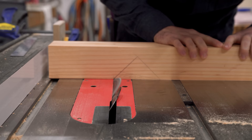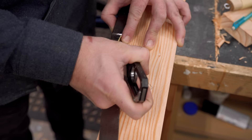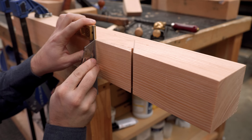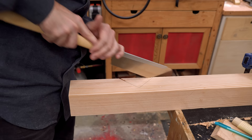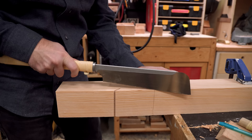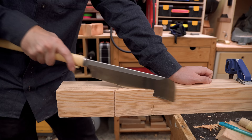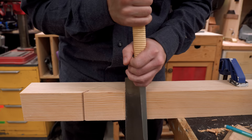I set my table saw blade at 45 degrees and set the depth at one inch, then I can use the miter gauge to cross cut all four of the posts. The next part of the cut could totally be done with a bandsaw but I wanted to try my hand with hand tools, so I started by knifing in all of the lines so that my saw would have something to follow. I flipped it over to the other side and cut again - I'm glad that I did this because as you can see my saw blade is drifting a little bit. It's really hard to capture that inside edge and there's a little bit of an arc in the center because of that, but that's fine - I'm going to be cleaning it up in the end anyway. I just want to make sure that I don't cut too much.